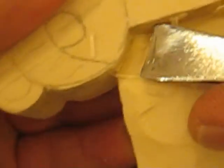You don't have to take big chunks out. I think a lot of times with accidents, we're taking off too much or trying to do too much at one time, or we're in a rush. So you sliver a piece out here and there, then take it out. See how nice and clean that is. If your knife is nice and sharp and sharpened correctly, it'll be a pleasure to work with. But if it's in tight areas like this, then I will use a gouge like this. I just wanted to share that with you.